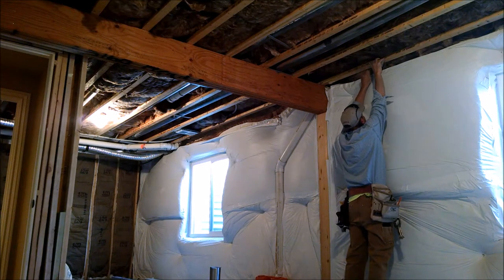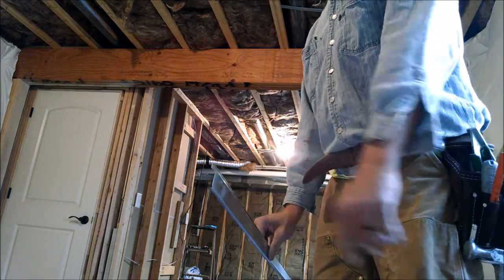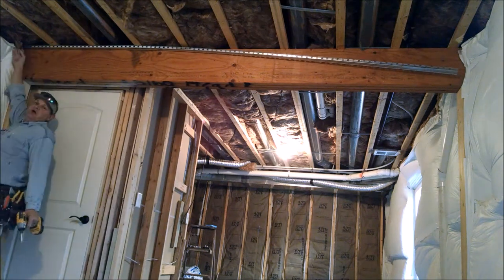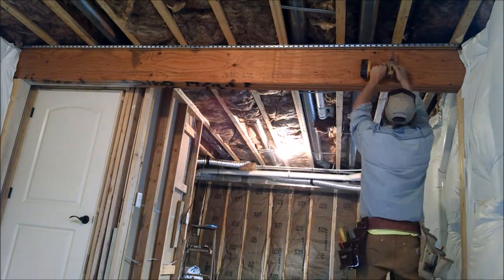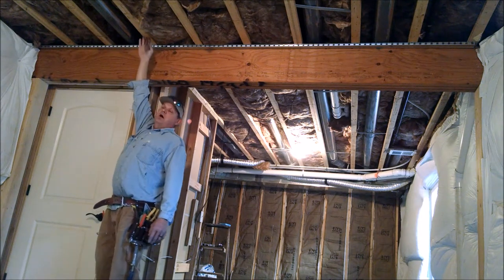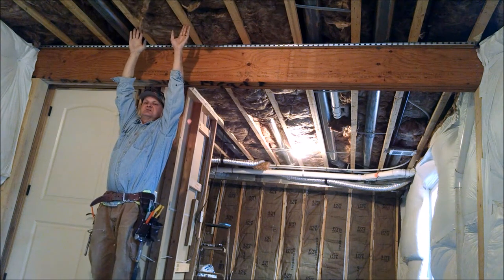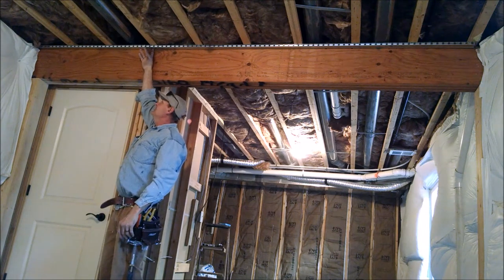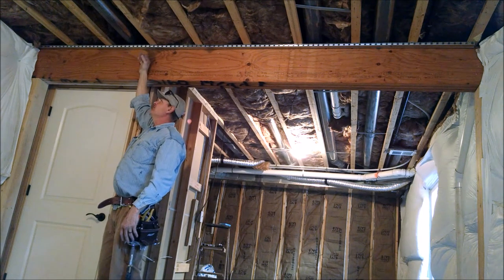You can go sixteen inches if you want, but I'm just doing every two feet. I'm using drywall screws, inch-and-quarters, to screw this to the ceiling. What this stuff does is keep the sheetrock off the floor joists, so when sound hits it, it doesn't transfer through the floor joists into the room above. It holds it down about a half inch from the ceiling, so it'll help keep the sound down to a minimum. It doesn't help a hundred percent, but it helps a lot.